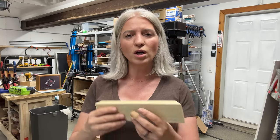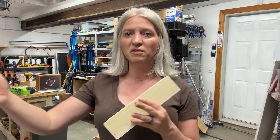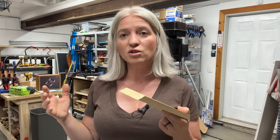Even with the blade set exactly at 45 degrees, if you let the material shift away from the fence for just a second, or pause while pushing it through, you'll get gaps. There's nothing more annoying than seeing your box doesn't fit together. The router table with a 45-degree chamfer bit works differently — there's only one point of contact, so it doesn't matter if your fence is perfectly straight. It will always produce a perfect miter every single time. Since miters usually end up on end grain, this also gives you clean cuts without tearout.